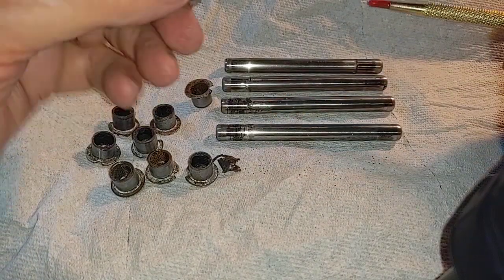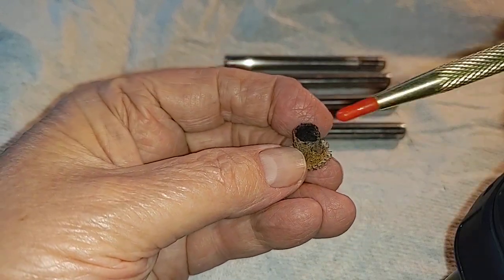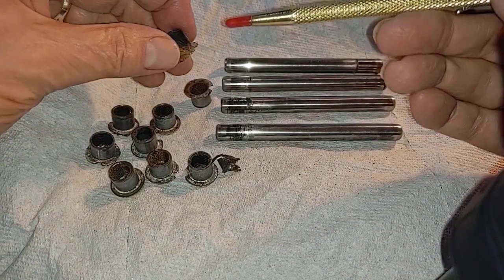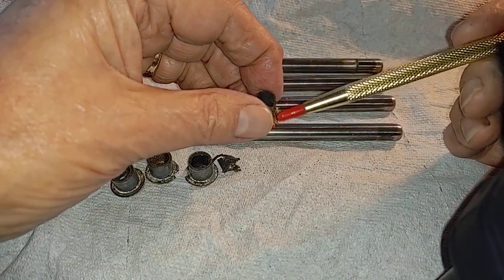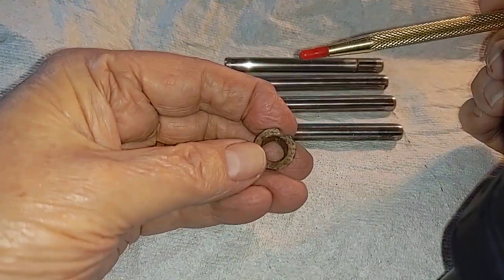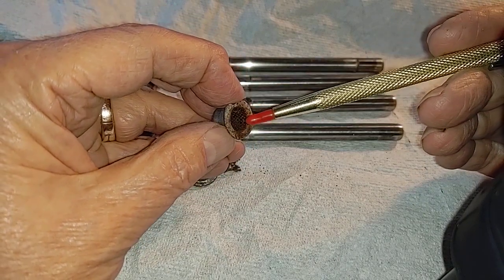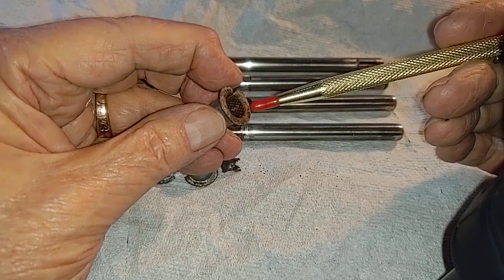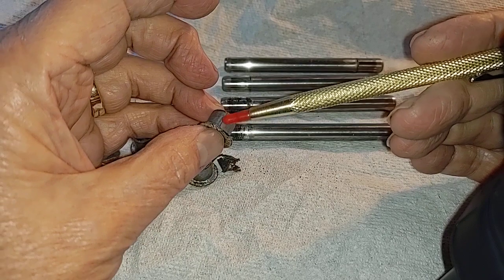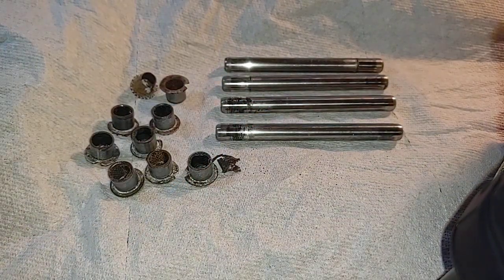The bushings are lined with a plastic. This is one of the liners that fell out of one of them. As you can see, there's a nice black plastic there, but it falls apart — this section is just gone. A bushing without its liner looks like this. Not a bad design — the inside's knurled so that the plastic has something to grab onto. They plate it through and it splits so it pushes in relatively tightly, but they just don't last. They fall apart.